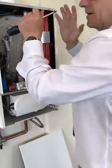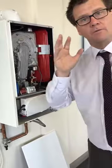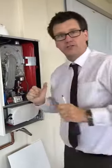Just to reiterate: if you get a bad reading on a boiler of a pre-mix type with some age on its back, make sure you check the burner first. Once you've checked the burner, then mess about with the settings all day long — no issues. Thanks for your time, guys. I hope I'm not boring you to death. Thanks.